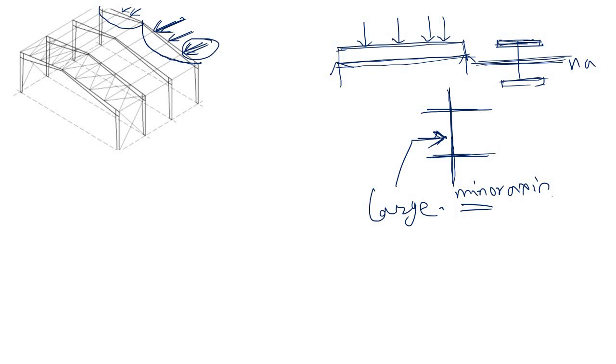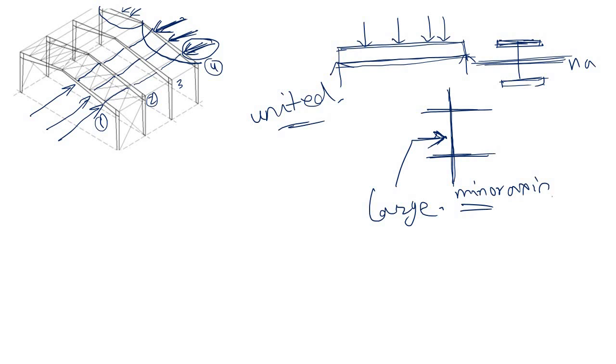If we don't want to use an oversized section, we need to bypass the lateral load so it doesn't affect our beam. To do that, we connect all the beams together. However, even when all four beams are connected and united, if the wind or earthquake load comes, all four beams will still buckle about their minor axis simultaneously. So we have to provide some bracing like this, which is finally connected with the vertical bracing.